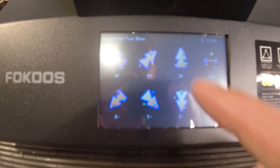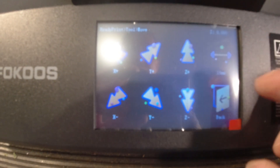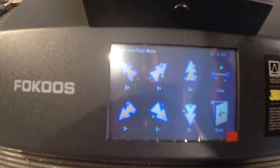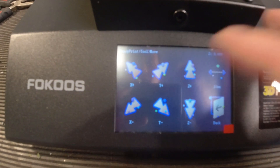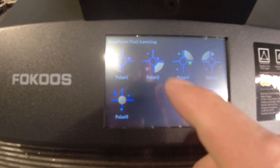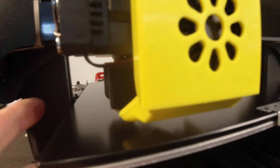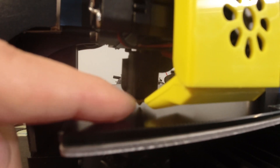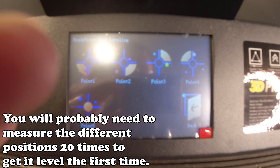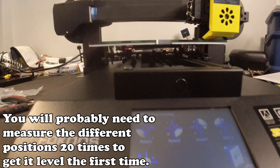After that's done, you can go into move and then you can move things around. You can adjust from 0.1 millimeter increments to 1 millimeter increments to 10 millimeter increments, and that will work now that everything's homed. You need to do the home first or you won't get the full movement out of this. You can also go to leveling — hit level here and that will move everything to the appropriate position. You bring the bed up until you can slide a little piece of paper between there and the nozzle and it fairly slightly grips it, then go to the next point.